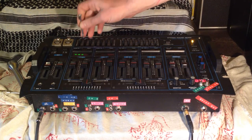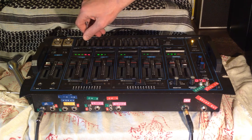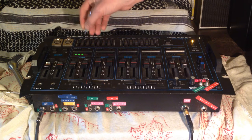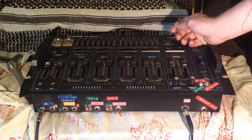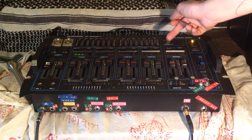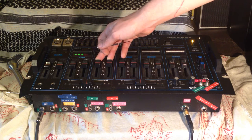Here it is at normal volume, and you can see it's already clipping a little bit because the output of the drum machine is fairly hot. I can drive it into distortion fairly easily. Each channel has that trim, as well as the master output. The master also has one-volt and two-volt outputs, so it's basically louder or quieter output depending on what destination you need to drive.